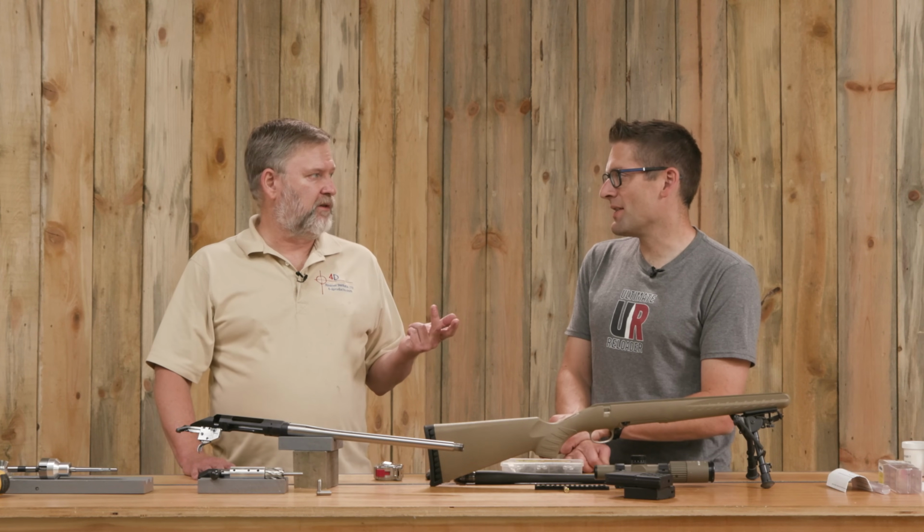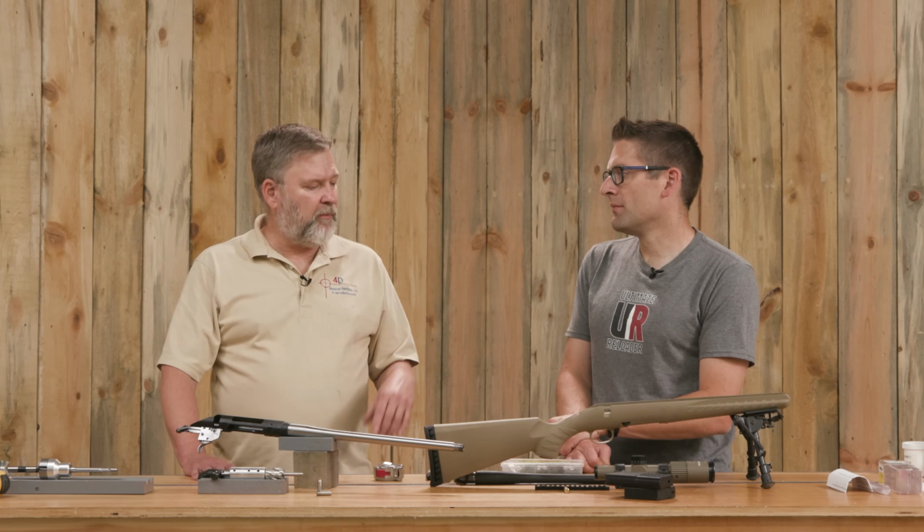And we measured more than one time, and I made a mistake in one of my measurements, which was one of the reasons we measured again, but I always measure at least twice. Because there's always the chance that you're going to have a chip someplace that's interfering, or some dirt or whatever. I always clean all the parts, take the measurements two or three times.